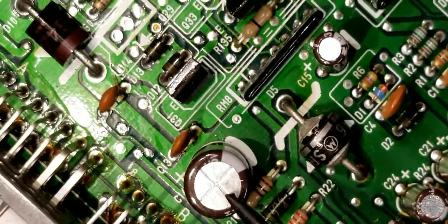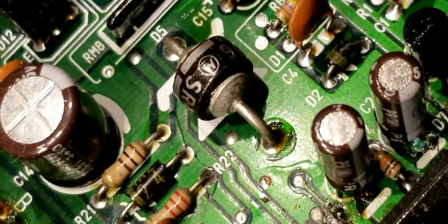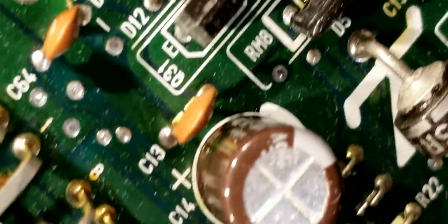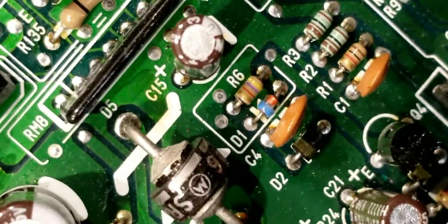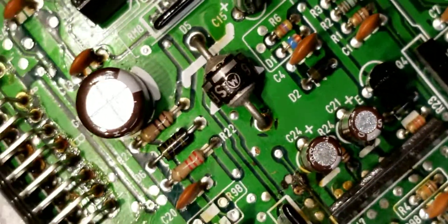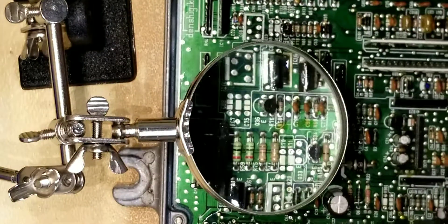Those are the main things you really got to replace — these capacitors on here. You don't want these to leak on the board. I'm starting to get some leakage down here, they're starting to go bad. So we'll get rid of C24 and C21 as well. Once I get them installed, we'll see if the ECU works. I wanted to point out that the front of the board is not a big deal — it's the back of the board that you're worried about. Stay tuned, thanks for watching, please subscribe.